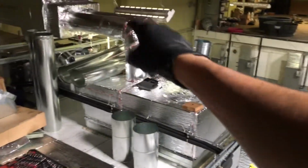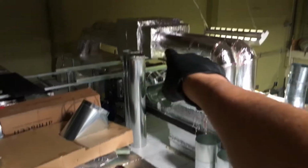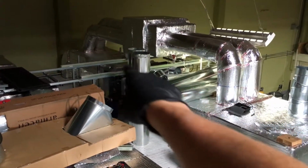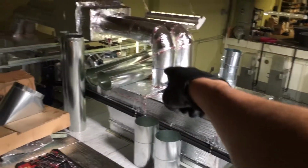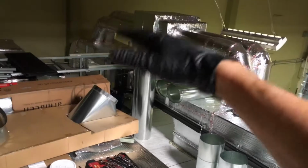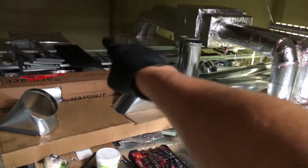Wait a minute, it's on the other side where the two dehumidifiers are, because we have tempered warm air already coming out and mixing with the cold air from the air handlers down below. The dehumidifier is bypassing up above, and since that's tempered air coming out of there mixing with the cold air stream, by putting the outdoor air here that will be cold 95% of the year, purging the room, it'll mix with that and kind of compensate for the 104 degree air that comes out of the dehumidifier that's mixing with the 48, 53, 51 degree air coming out of the air handler.